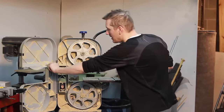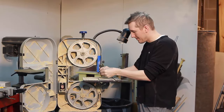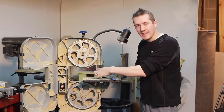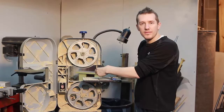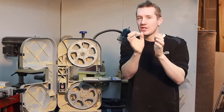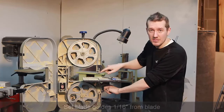Next, the adjustments. This saw has an Allen wrench right on the side — you can remove the blade guard. On the sides, the two side adjustments: typically there's a friction material or two bearings. This one has friction blocks on the side. They should be just barely not touching — maybe a sixteenth of an inch away. They're just there in case the blade gets off track. The top or bottom positioning of the side adjusters is not very critical.